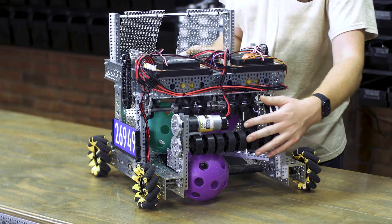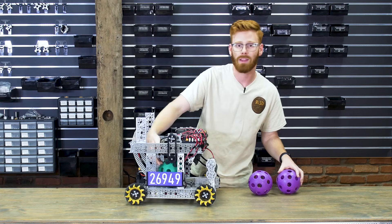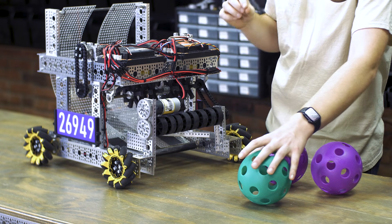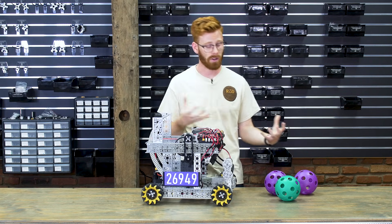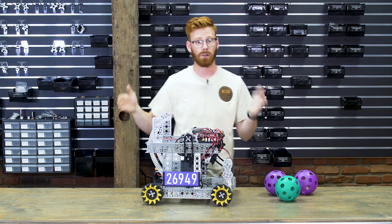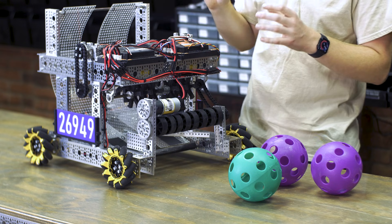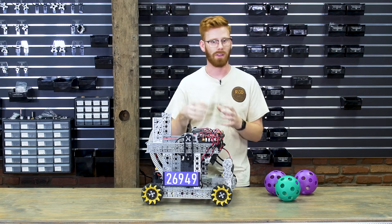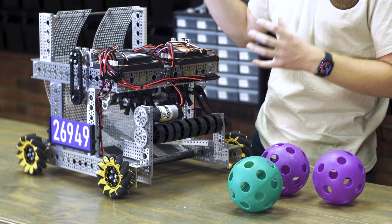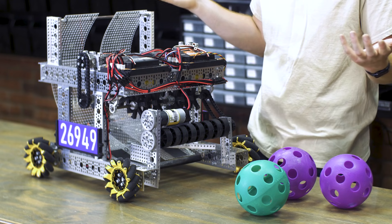The artifacts are 5-inch diameter wiffle balls and you're allowed to hold three of them. A key improvement over the Starterbot was the ability to create motifs, especially in Autonomous — it's an advantage to start with three preloaded elements and decide which to fire, since the exact pattern is randomized every match. This double shooter approach lets us do that. Having two launchers is pretty much just as simple as having one, and it effectively solves the motif problem without requiring an incredibly complicated mechanism.